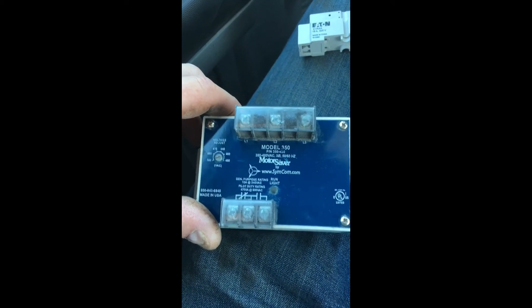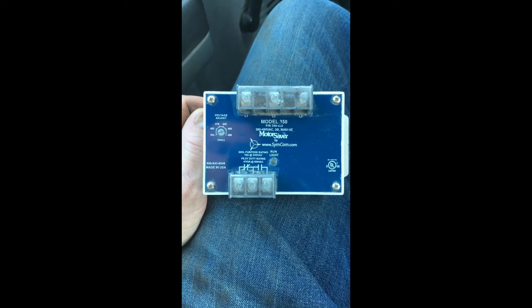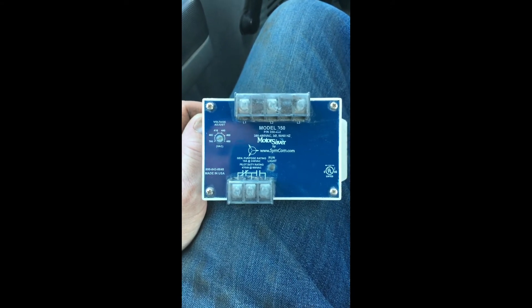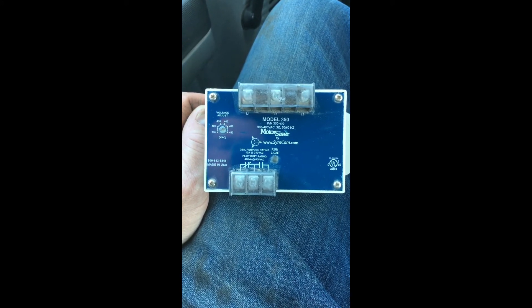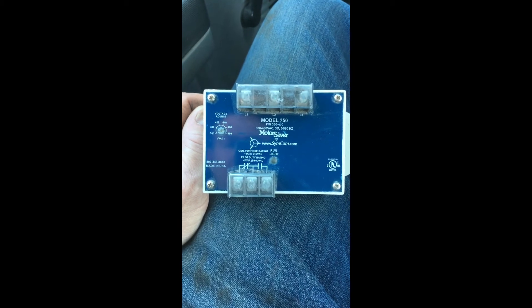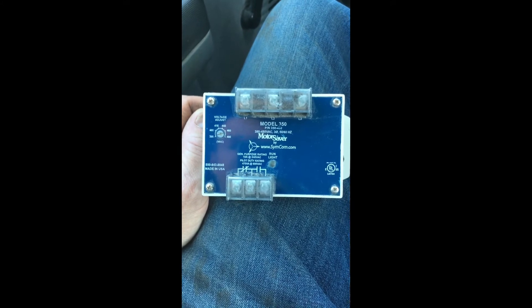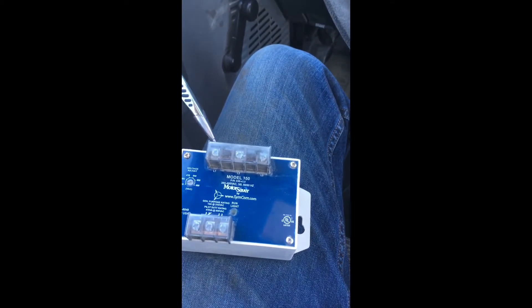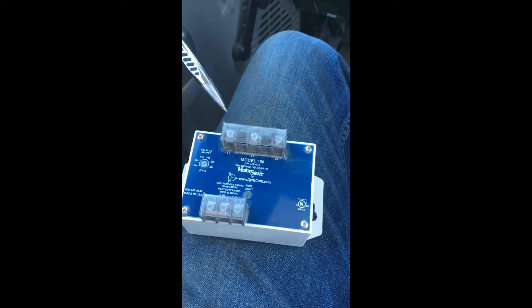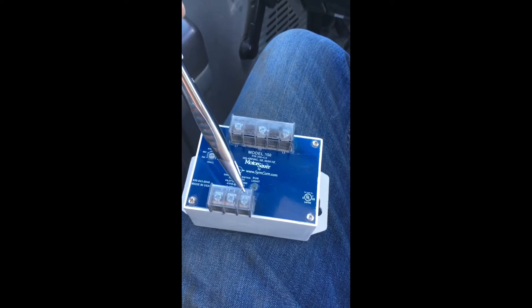And that'll give you is it'll break your circuit based on this. That's pretty much it. So we just explained how to hook up this motor saver. There's another type of motor saver that has a delay. If you have that type, the reason for the delay is it may have a time delay on it, so when it sees the voltage and everything's correct, it'll wait whatever the time is set for before it makes these contacts go.